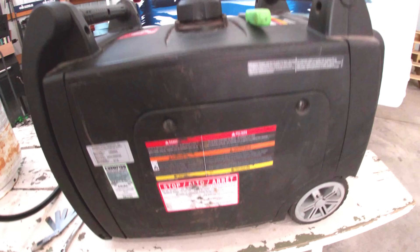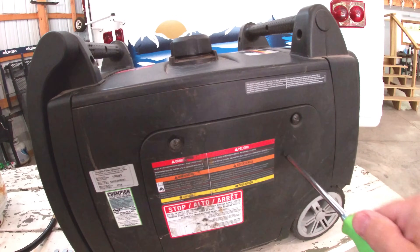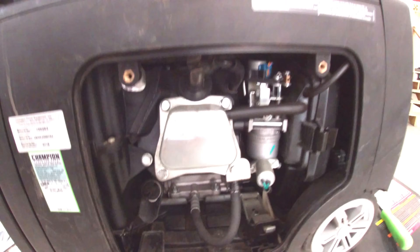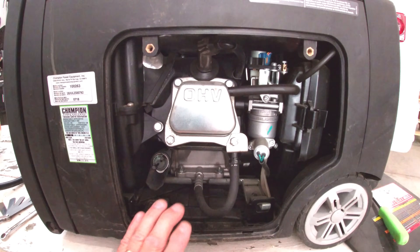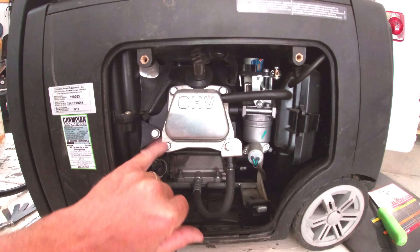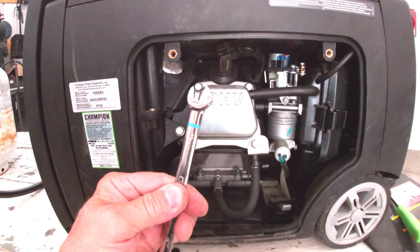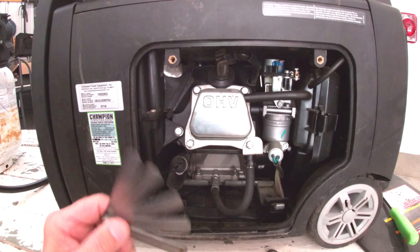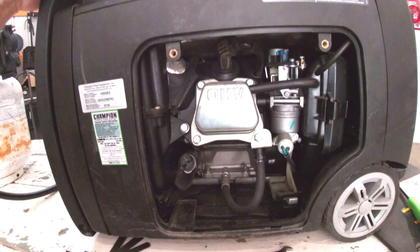Let me show you a little bit about the maintenance she was talking about. On the backside of the generator there's an access cover. Remove that, and underneath is the valves. I try to carry a bunch of tools when we travel, but a couple things I didn't have were a 10-millimeter wrench and a set of feeler gauges. I had 10-millimeter sockets to take the cover off, and underneath are the ends of the intake and exhaust valves. I ran around Quartzsite and was able to find a 10-millimeter wrench and a set of feeler gauges. You have to use the feeler gauge to set the clearance on the end of the valves.